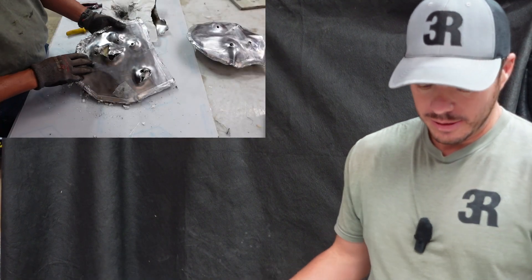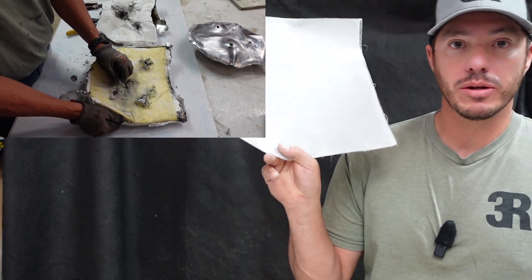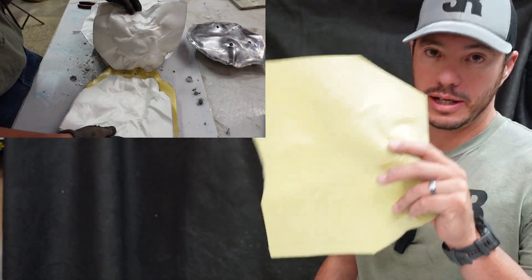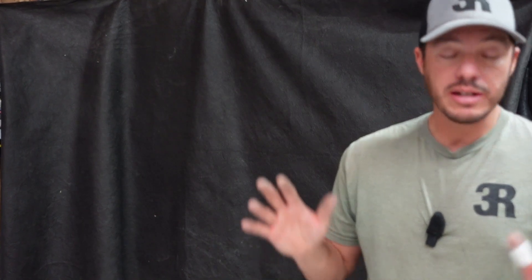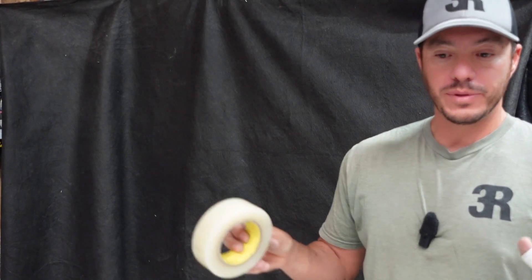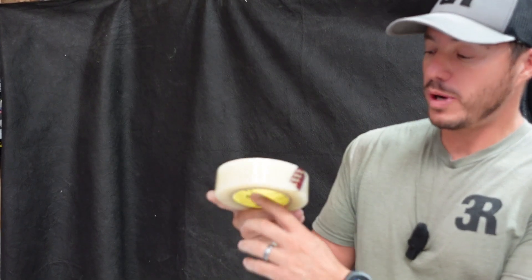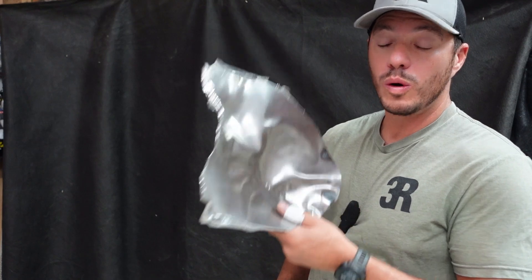That was the basic first plate: tile wrapped in Kevlar, then unidirectional ultra-high-molecular-weight polyethylene, and then a unidirectional Kevlar layer with the same type of construction as the polyethylene. For that first build we didn't press the polyethylene or the Kevlar — we just put 40 layers of the polyethylene and 10 layers of the Kevlar, put them together, and taped them — just as we wrapped Kevlar around the tile, we taped the polyethylene together to try to contain it.